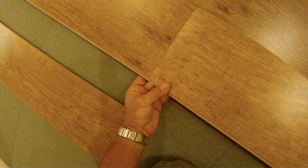So that's the piece of board for the next row — let's just see how that lines up. You see, near enough the angle — maybe could do with a bit more trimming, but certainly better than if we'd just left it flat. So let's see if this one fits now. Again pull the previous board out a little bit, make sure it accurately lines up between the left and right hand board. Now we've got a nice fit there. Tilt it up, push it in as much as you can by hand — but you know it's not clipped in fully because it's not lying flat. Try and minimise the gaps. There's a little gap there, so just push that over a little bit.